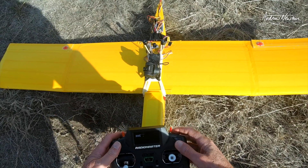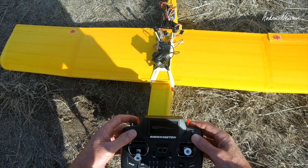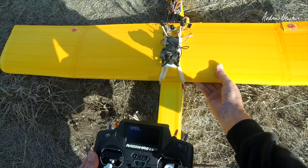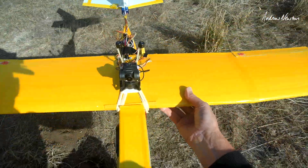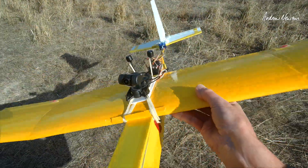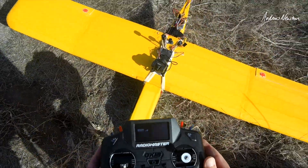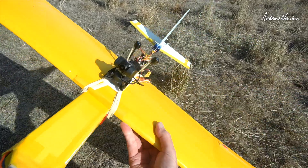We can see we have pan and tilt. I've limited the tilt range to just 20 degrees up and down, otherwise it'll go way too far. I have modes on the switches: that's fully self-level just following the yaw, the middle mode, that's following roll but not pitch, and FPV mode — which is the only one I can safely fly in really — is kind of follow everything.